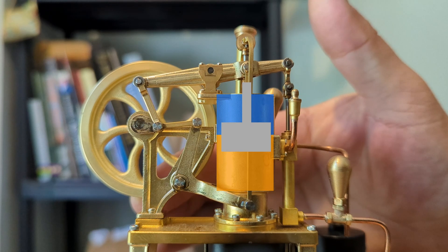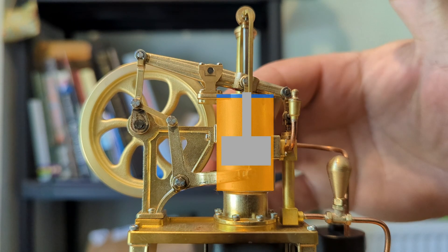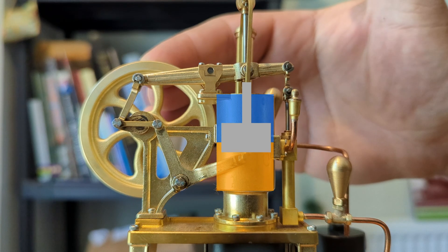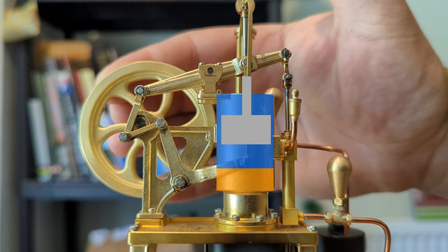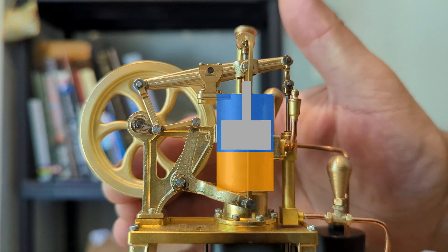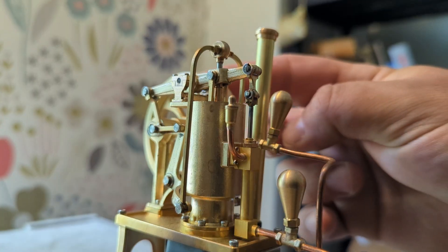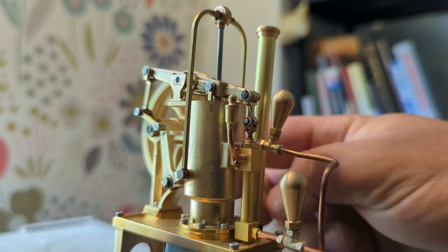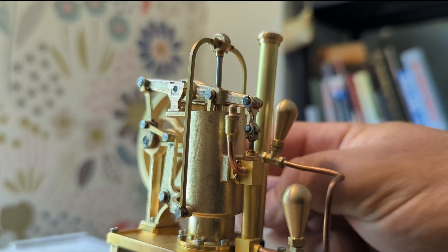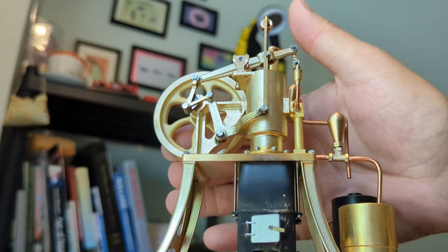As the displacer moves, it literally displaces the air from the hot end and the cold end of the cylinder. As the piston goes up, the displacer also comes up, displacing air from the cold end. This cold air has already begun to contract and that draws the piston back down. As the piston drops, the motion causes the displacer to follow it, displacing the hot air from the bottom of the cylinder back to where it can interact with the piston again and push it back up, completing the cycle. It is beautifully simple — there are no external forces, everything is contained within it and it just works.